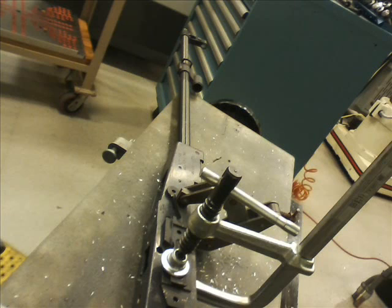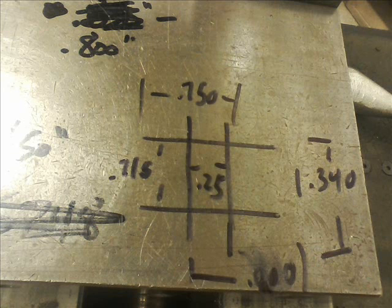Then I used two clamps to hold the scope mount on the rifle. I used a wiggler gauge to find the holes, to indicate them and drill them. I just used the mount itself as a drill guide for drilling the three rivet holes into the side of the rifle. As I drilled the different holes, I'd take one clamp off and use another clamp to hold it so it wouldn't lose its position.